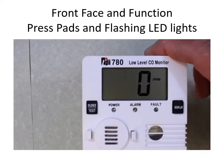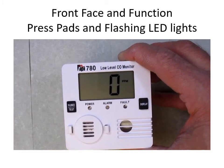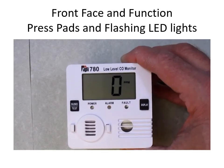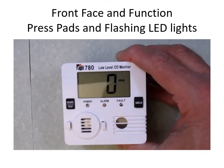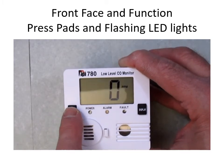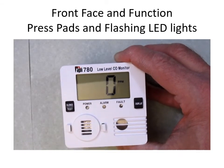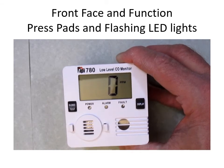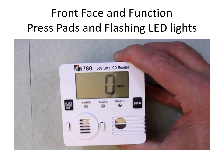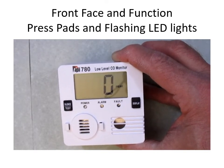Some of you may be surprised to see numbers appearing on the screen, or it may alarm in less than 30 seconds after you've activated this detector. Take a look around where you are — you may be in a place where carbon monoxide is present. Now you have the ability to know more about your home. Looking at the front of the unit, you'll see the large display and press pads on either side. The display on the right shows real-time measurement of parts per million of CO. One press of the display button switches it to peak — the highest reading in the last 24 hours, a continuously updating 24-hour window.